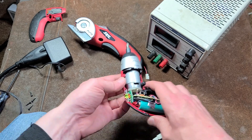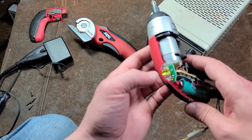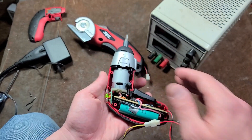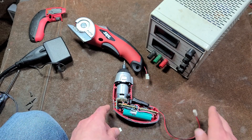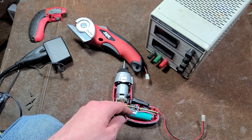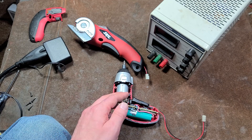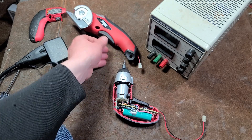When I plugged this into the 6-volt adapter, this tool has a nice charging light. It always shows green when it's charging and will show red when it's running low on battery. I turned it up to 5 volts and it turned out that the little LED was just barely illuminated, which told me it's obviously not enough. I moved it up to about 5.5 volts and that LED seemed to be reasonably bright, but 5.5 volts is a pretty rare voltage.